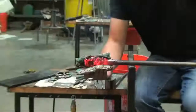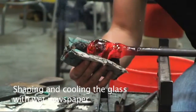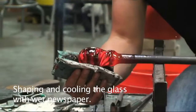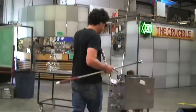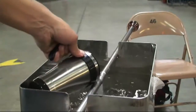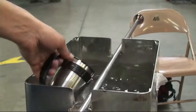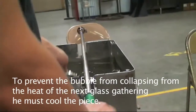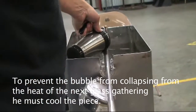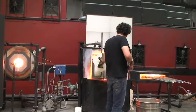Now he's using the newspaper to shape and cool the glass before he gathers it. The gather that he has is going to be heating up, so if he lets it cool down he'll have a nice stable foundation so that when he gathers over it the glass will instantly start heating that up. And if the heat is too hot and heats up too fast, that bubble just becomes liquid and starts to collapse.